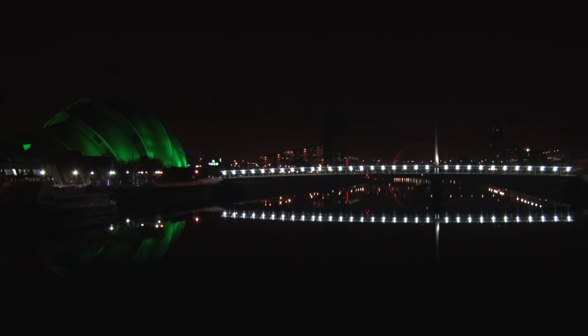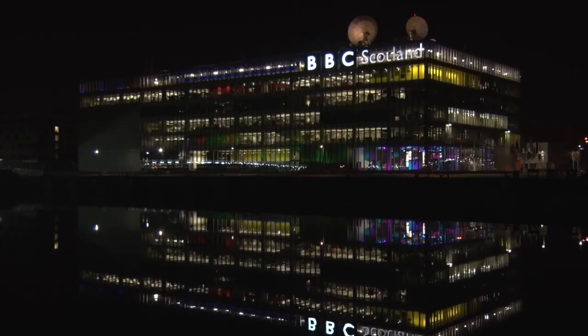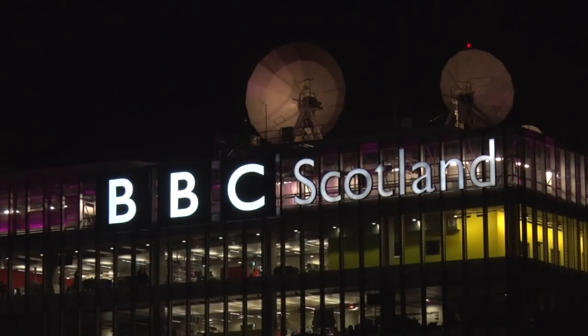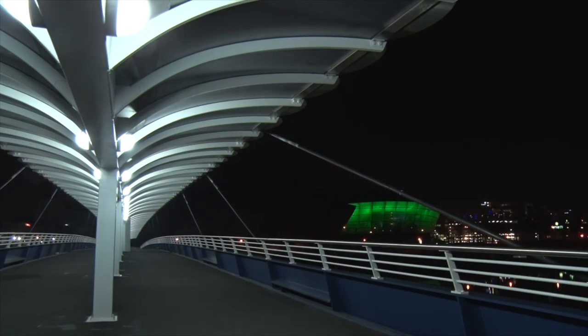I ran some low light tests just last week — excellent results. I shot in darkness with bright subjects in the foreground, lit buildings, riverside scenes with shimmery lights. The colours were excellent — very impressive what I was getting out of the camera colour-wise and detail-wise. I was fairly wide open most of the time to keep light levels as high as possible. At zero dB it's very good. You could probably get away with 6 or 9 dB and it's still usable and not too noisy. Compared to predecessor cameras, I think you'll be quite impressed with the noise performance on various gain settings.